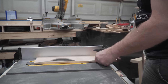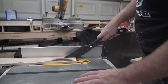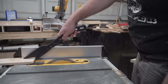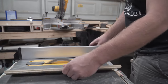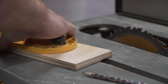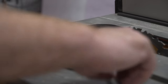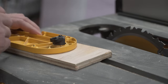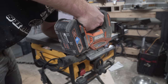We'll start with a piece of plywood or hardwood about the thickness between the mounts of your factory table saw plate and the surface of the saw. Fortunately, on this DeWalt, that's exactly half an inch. Next, using the factory insert plate or precise measurements if the factory plate doesn't fit very well, trim your plywood down to the width of the opening. From here, we'll use the factory insert plate to mark your piece of plywood for the two curves that we'll rough saw out with a jigsaw. When you're cutting this with a jigsaw, make sure you leave the line because we'll be cleaning this up with a flush trim router later.